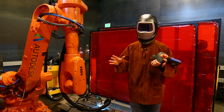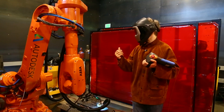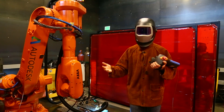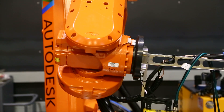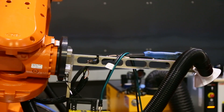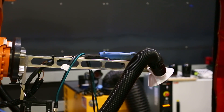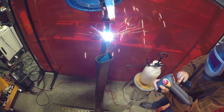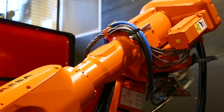Ultimately the motors in the robot arm are told to move this way — the human's original instructions are just more abstract and filtered through additional layers. Using a teach pendant would be impractical for these complex curves. Normal 3D printers operate in basically two-and-a-half D, but this robot can point in various directions. It needs to know not only where it is but how it should point when it gets there, so you give it a piece of geometry and the software figures out the instruction set for the robot.